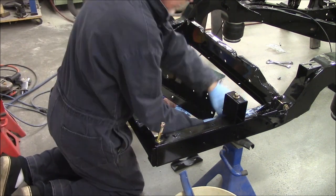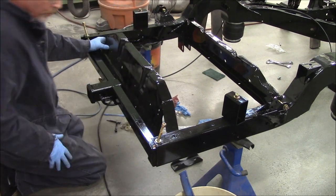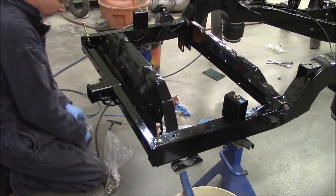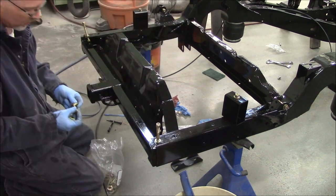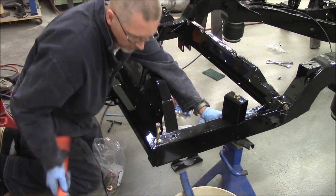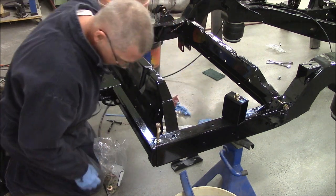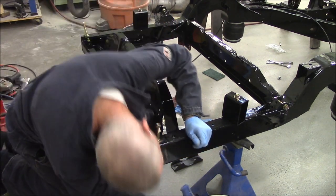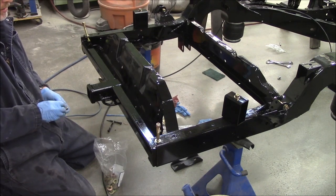At any rate, this last piece was originally riveted into the frame from the factory, but I made a whack of changes. I will probably put a link up above to where I did the work on fitting the gas tank once I make that video. Half inch grade 8 bolts, some from the sides and some up from the bottom to hold this whole thing in place. I got grade 8 washers and I used Nylock nuts. My thinking is the Nylock will help bite onto the threads and stop moisture from wicking its way in, corroding, and then making it impossible to disassemble this.